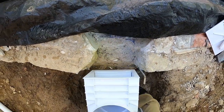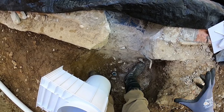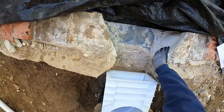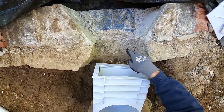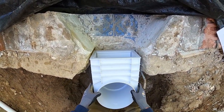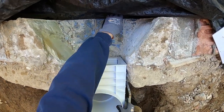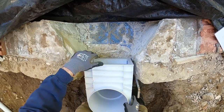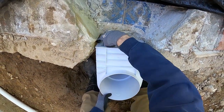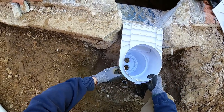Here's the site. Looking straight down into the throat — this is the area we demoed. We used a small rotary hammer with chisel bits to bust out all the old concrete. The tiles were already failing in the throat, so we got those off along with the mortar bed. You can see the existing plaster of the pool right where the old skimmer face was attached. We'll make sure we get the height completely level with the existing skimmer throat and get it parallel with the throat opening so it's not cocked to one side.